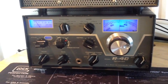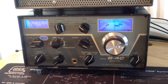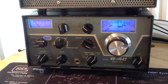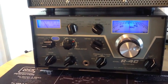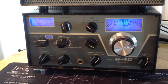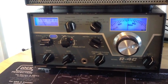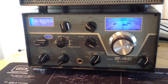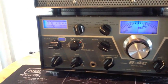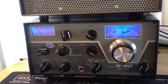Time will tell — I'll have to operate this radio a little more and get a better antenna out there. Right now I'm just using my mobile whip, which is not very good, and it's close to some high noise sources. This is the Galapagos Islands I'm listening to — quite a pile-up with some good stations coming through. It seems to be as sensitive. I do need to get a 22K resistor so the S-meter will calibrate, because right now it's cranked up all the way and still won't cal to zero — way off. That's an easy fix: just one wire to ground and one resistor.